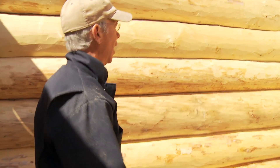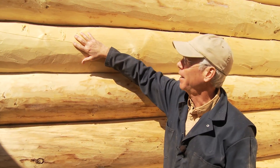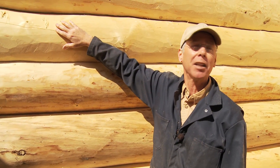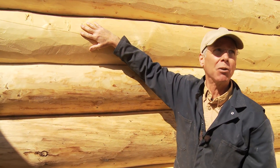So if it's left-hand on the outside, we try to put that log low down in the building where there's lots of weight on it and it can't twist so much. The right-hand trees and the straight grain trees we're free to use wherever we like. How do you judge right-hand spiral? For me it's like asking a batter how he judges a curveball — I can just look at it and see it. But here's the trick: you put your right hand on the log, and if the check goes the direction of your fingers, it's right-hand. If the check goes the other direction — the direction of your thumb — then it's left-hand. So putting my right hand on this log, the check is more or less going the direction of my fingers, so it's right-hand.